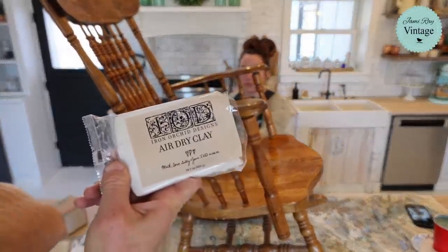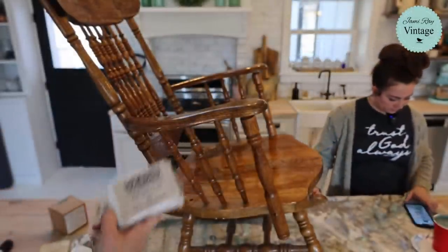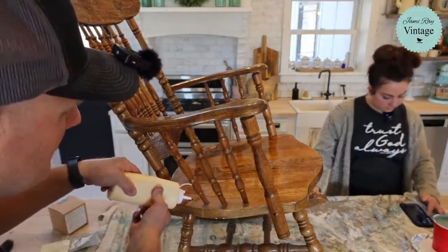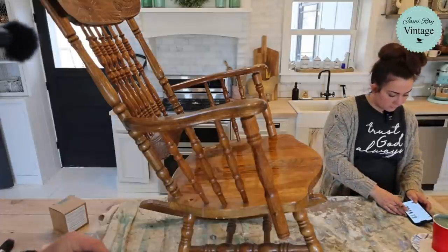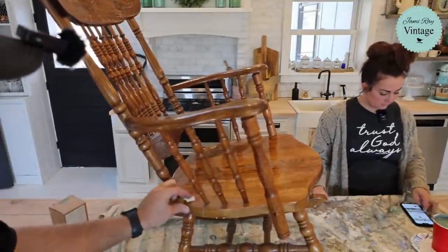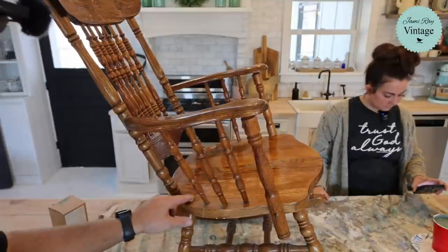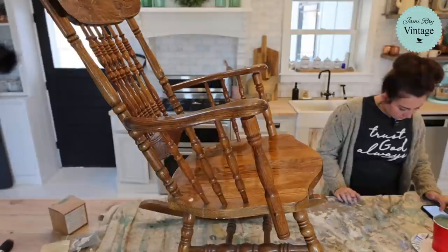Zeb's going to show you a quick way to fill holes. This is the IOD air dry clay from Iron Orchid Designs — it's a paper clay. It does harden up pretty well, almost like plaster once it's all cured up. I'm just going to drop some wood glue down in the bottom because it will stick really well to the paper clay, drop the little piece in, and just go until it's flush. That rung on the other side was completely missing, so I pulled the rung out of this side, made sure it was still sturdy — and we're good to go.